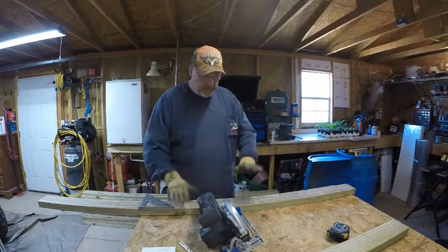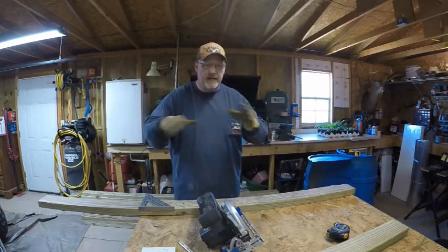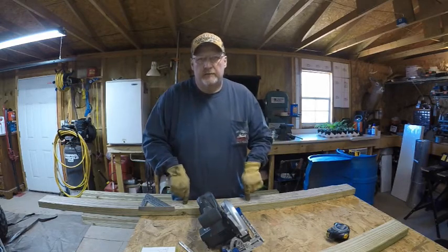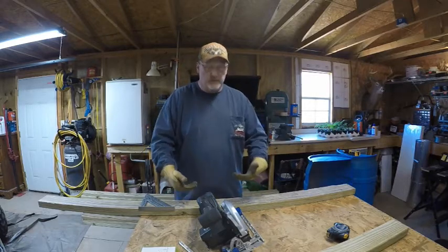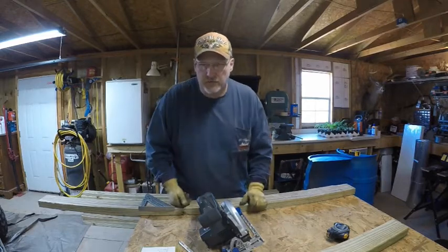It's not going to be touching anywhere. If I was building a raised planter box out of strictly wood, then I would not use treated, because the chemicals, you know, obviously the dirt in there and in the water, chemicals could leach out of the wood into the dirt, in turn get into your plants, your food.